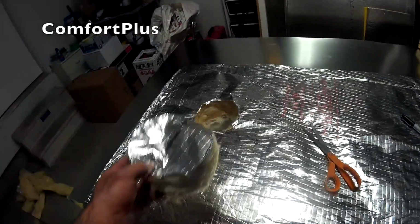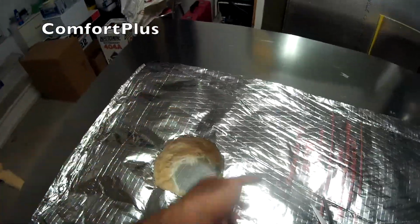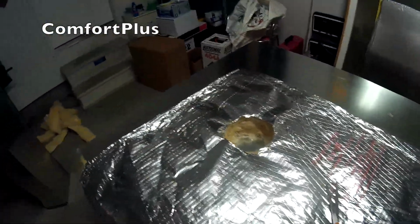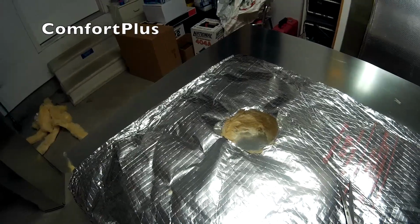But at any rate, got that hole cut. I can just slip it over top of this takeoff and be a lot less taping involved. I used to try to slit it like 6 ways and just push it over it and then cut off the little tabs, but this doesn't really take much longer, and it does a lot neater job around the fitting.